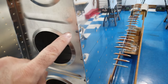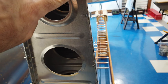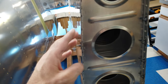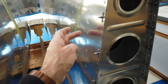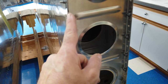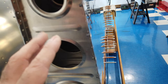At that point I came back and made sure there weren't any chips left in between the skin and the rib. You don't want any chips in between your stack. Same thing on the top of the wing where you have the extra piece of aluminum that makes up the wing walk doubler — so you've got three layers of material on the top side of the wing, and you want to make sure you don't have any chips in between the layers.